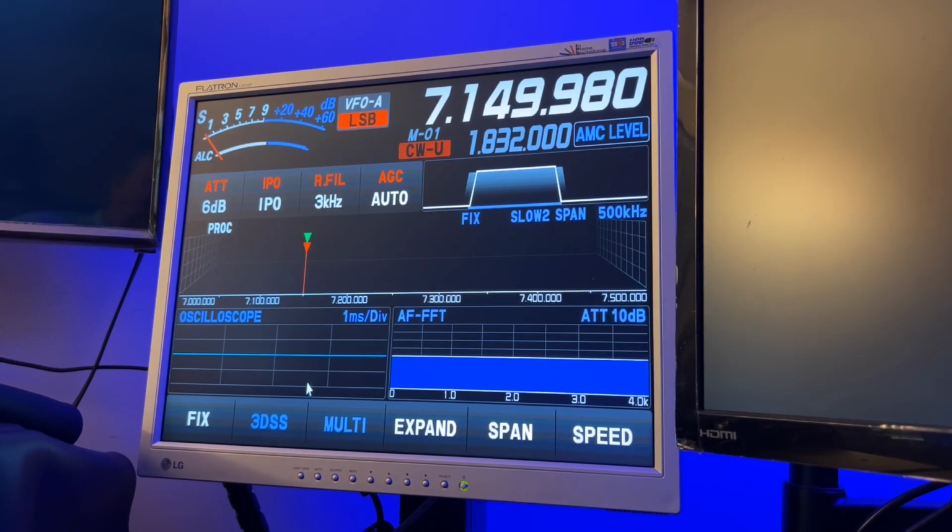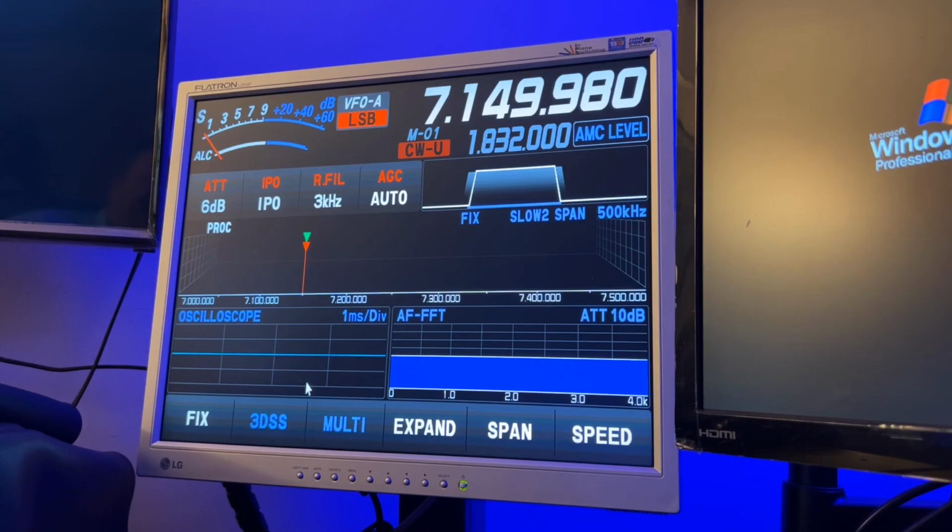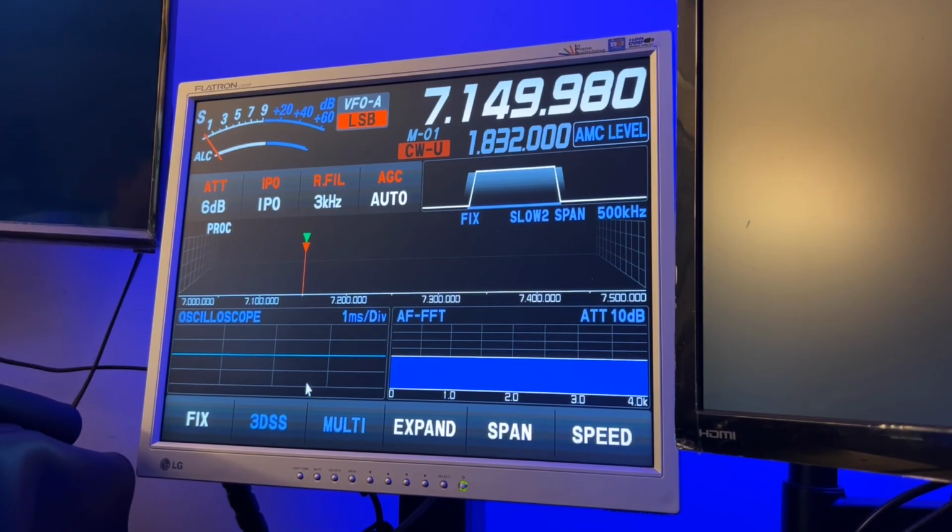I would say, well, 2 biggest variables in the settings I'm giving you are mic gain and that 300 hertz, whether you're boosting it at 10, boosting it at 7, boosting it at 5, which is the default. Those are the 2 things that'll make probably a little bit more difference as far as everybody's varying types of voices. And remember, the 1300 hertz and the 2400 hertz, maybe try plus or minus 100 hertz with your voice and see if it makes any difference.